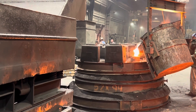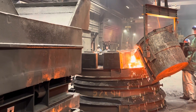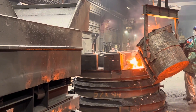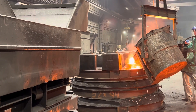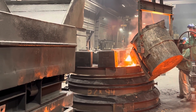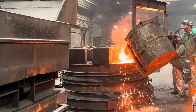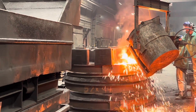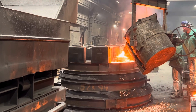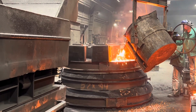Here is the actual pouring of the mold. This iron is tapped out at about 2700 degrees Fahrenheit. This is a ductile iron casting, and we're pouring the outer section of the wheel right now — that's going to be about 1500 pounds of iron. Then we pour the center hub, which is another 600 pounds.